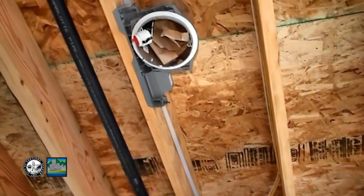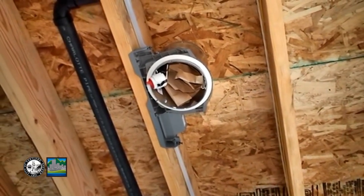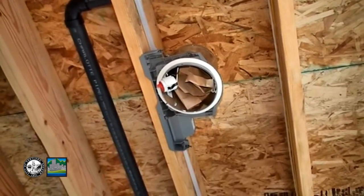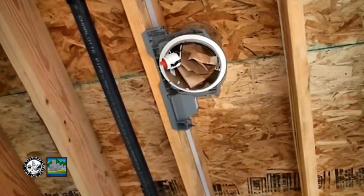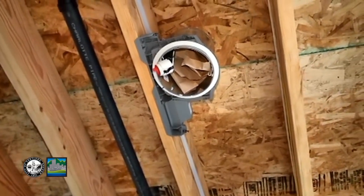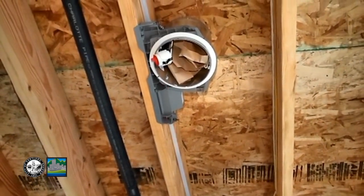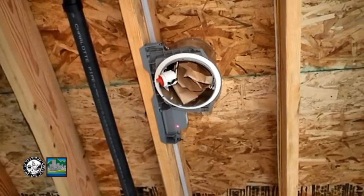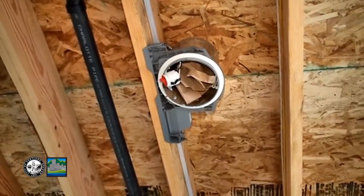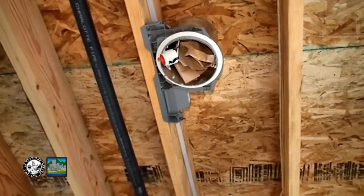As we come up the water system, pay careful attention to this little piece right here. On the cold PEX side, it's too close to this light right here. It has to be 12 inches away or it could be subject to melting — these can lights get very warm and we don't want that to melt the pipe. So we're going to have the plumber fix that. As you can see, the PEX pipe runs behind the can light. Aquapex requires a 12 inch clearance between the recessed lighting and the Aquapex piping because this creates heat. We want that clearance to be there.